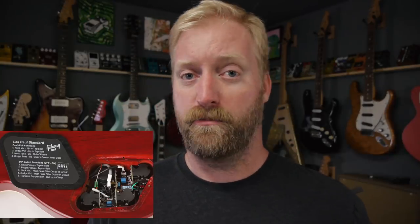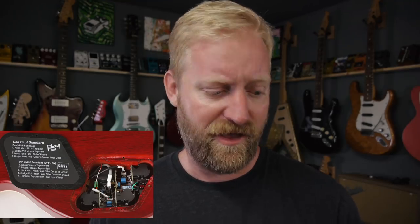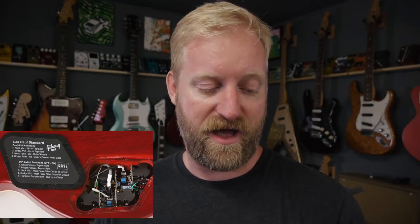Let's go over what they do. I've got a picture of the control plate right here. I'll talk about the push-pull knobs first — there are a bunch of options that sound great to me, the sort of thing I do to my own guitars. You get a push-pull to coil split each pickup individually. Then you have a push-pull on the neck tone that gives you out of phase, which is something people have been doing to guitars for a very long time. And a new thing — the bridge tone push-pull lets you select which coil is activated when you coil split. I think that sounds like a great option. Now let's get into the controversial dip switch bank.